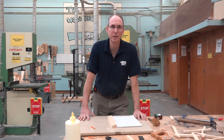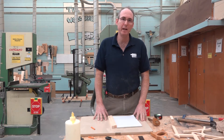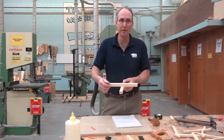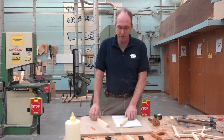I'm going to show you an introductory project. This is a very simple woodworking project where you're going to use hand tools to produce something called a half lap joint. A half lap joint is just where one piece of wood laps over top of the other and you cut both pieces so that they sit flat and their surfaces will sit flush.